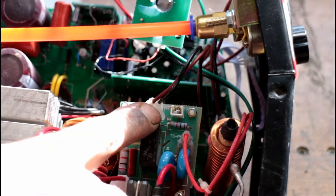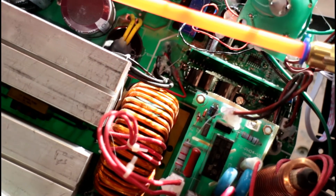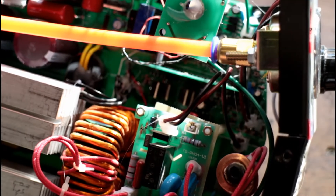This I'm pretty sure is the high frequency board. Again, just covered in hot glue. What I found was it was actually loose on these nylon mounts and it was touching the bottom, which also has a piece of that crappy insulation on it. Because this board buzzes at a high frequency, it actually moves when you start it. Because it was loose, something damaged internally — something's fractured — and I can't get an arc.